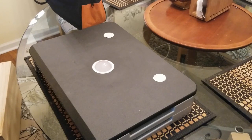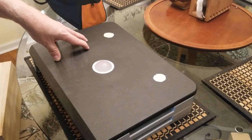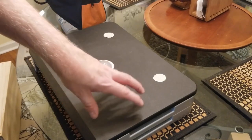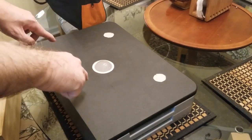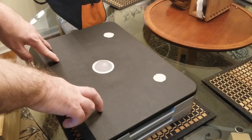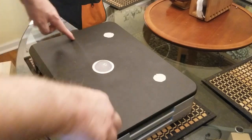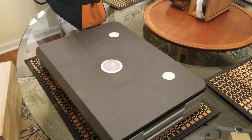All right, so there'll be a total of 11 buttons placed on the board. Let's talk about the buttons a little bit. 4 of them will be to the left of the trackball, and then there'll be 4 to the right of it. And again, you're gonna wanna place them symmetrically. Again, use a little masking tape to map it out beforehand, and then measure to make sure you got symmetry. And then don't go too far to the side, because again, you don't wanna get blocked by this. All right, so each of these holes will be drilled with a 1 1/8 inch hole saw.